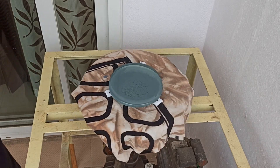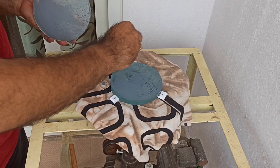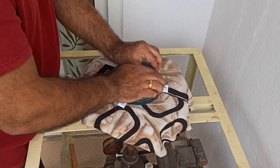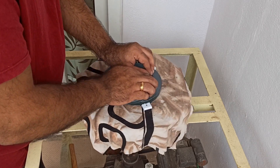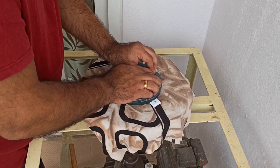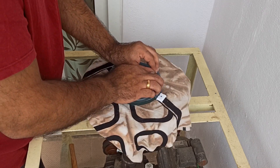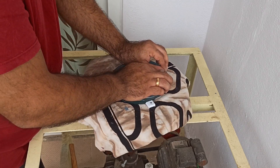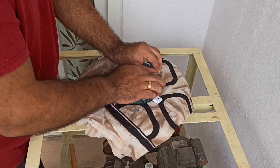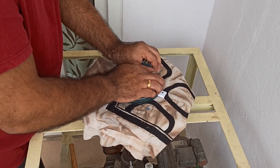Once the slurry goes a bit dry, I don't clean the surfaces — I just sprinkle a few drops of water and continue until it becomes a finer paste and the sound stops. The motor sound is quite loud and I wasn't able to hear the grinding, but experience shows you can see the fine paste form when the grit is completely used up and it's time for a change. When I change the grit, I once again clean the surface of the mirror and apply fresh grit.